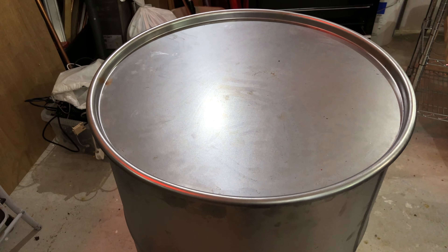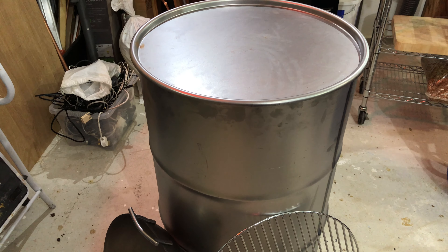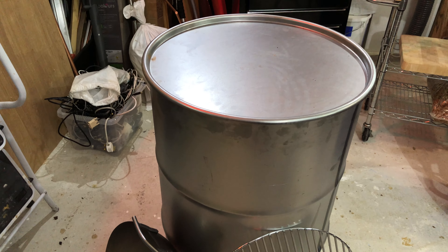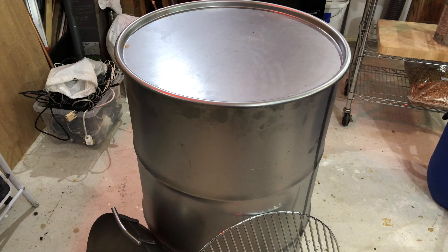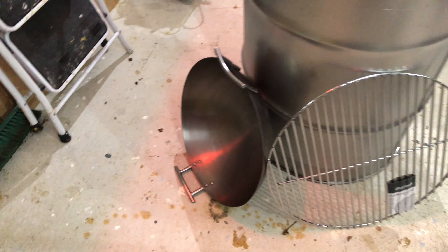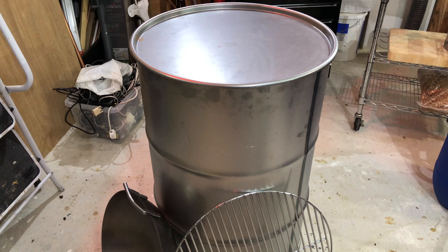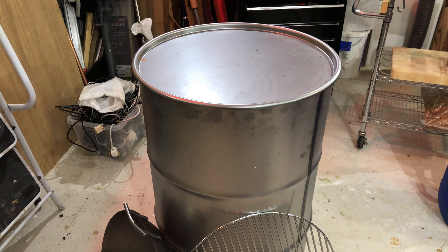So that's the drum — and that's the lid. The thing about this drum is you might have noticed it's not painted. Don't buy a painted drum — what a nightmare getting that paint off. You've got to burn it off or sandblast it and it's just disgusting. If you buy one of these unpainted drums they're slightly dearer but there's just a protective film on it that'll come off with acetone ready for spraying. You also need to cure your drum — once you've done all the build work, paint it, then build a mighty load of charcoals in there, let it burn out, and prime the drum ready for smoking for real.